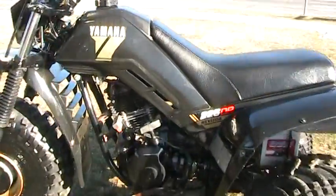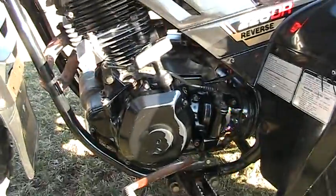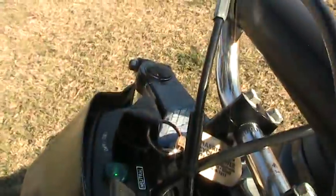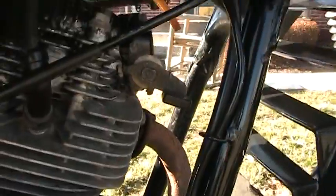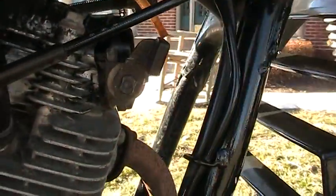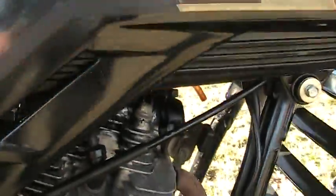On this side of the vehicle is the pull start. You have to set your choke and turn your key switch to on. Now, this is why I'm showing you — on this side there's a compression relief valve. You flip it and that opens the compression up, so that when you pull it, being a high compression engine, you'll be able to pull it to start it.